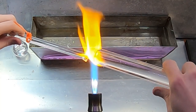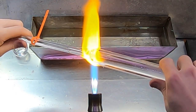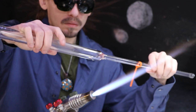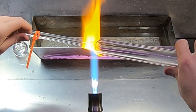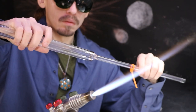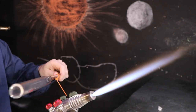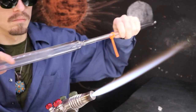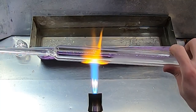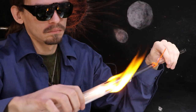For a very strong connection, I want to heat up both sides to a very molten, liquidy state and connect them together. I'll pull that connection out just a little bit, but it's important to keep both tubes in line on axis. It's not the prettiest connection — I think I need to warm up a little bit getting back at it. But lampworking is definitely like riding a bike; you don't forget once you learn. It's holding the weight of this tube, so it's looking like a strong attachment. I've had a few pulled points break off because I pulled them out a little too thin.